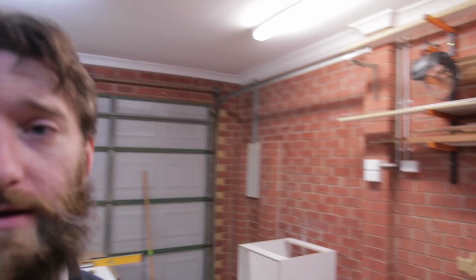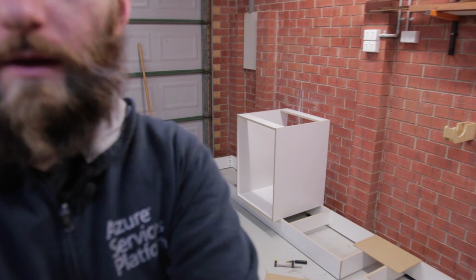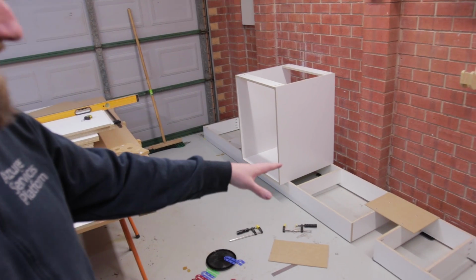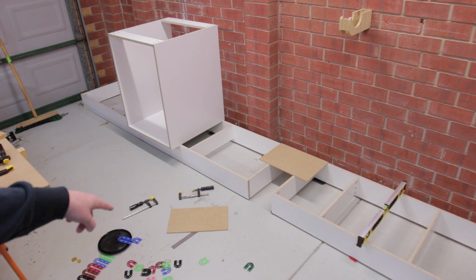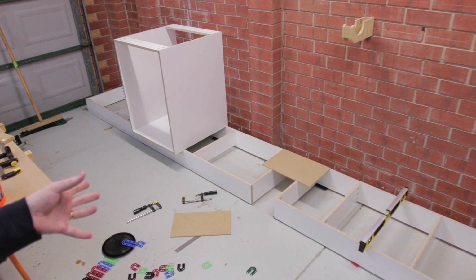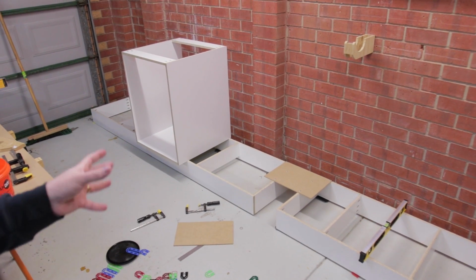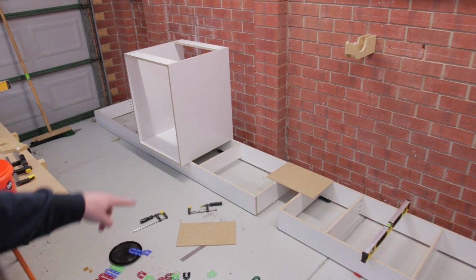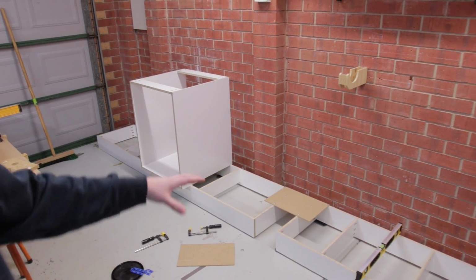So I know this is all over the place today, but bear with me, it's been a very long week, and it's only Wednesday. The plinths are a little bit higher than I normally have them, at least for garage stuff, because you can see where the two of them meet. I'll be running some pipe through there. I'm going to eventually upgrade to 125mm or 5-inch ducting, and that gives me enough clearance. That's 200mm wide and 150mm plinth, so even with whatever the OD of the connectors are, that should fit just fine.